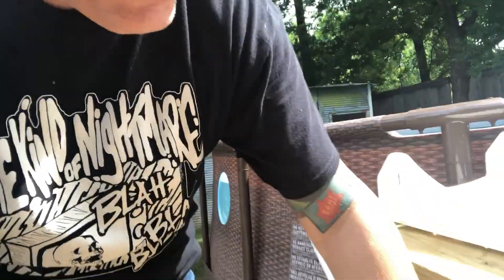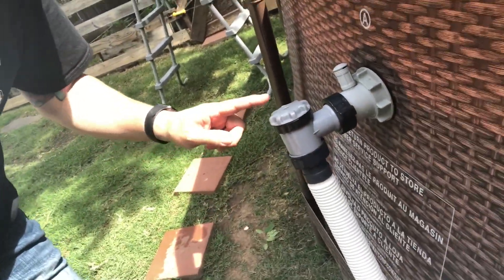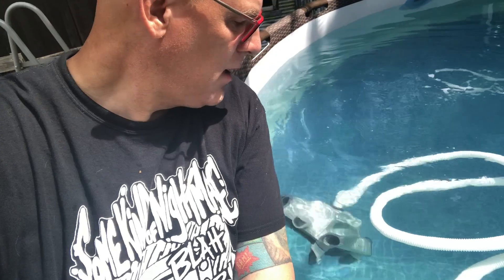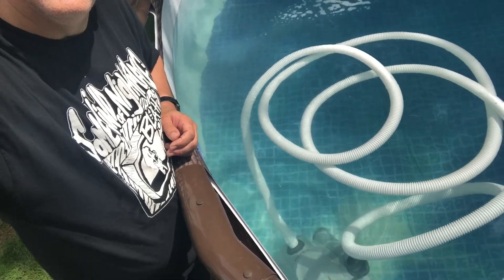We cleaned it out and put it back on. Now we'll hook the vacuum back up and you'll see how it goes right when you turn it on after it's been cleaned — earlier it had stopped. We got both parts clean and put back together, the vacuum's in there ready to go. Go over here and turn your pump back on, and make sure to open this valve back up. Make sure your valve is open right here for your outlet. Turn the pump back on — you can hear it go. It's getting water, getting the air out — it shot right back to the top.